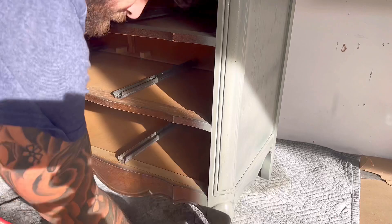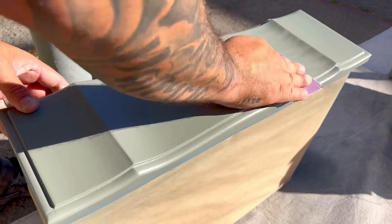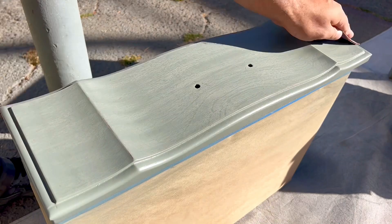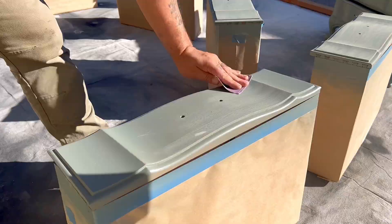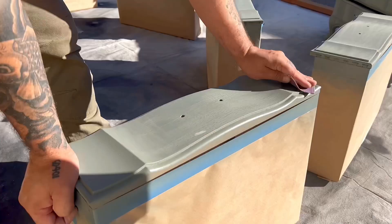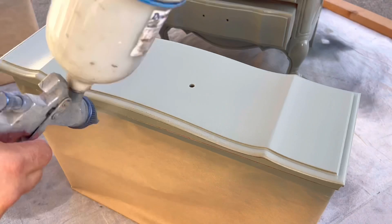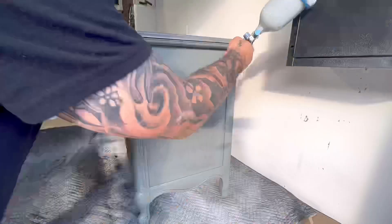After the first coat I like to use 220-grit for a scuff coat, then switch to 400-grit after that so I don't leave deep scratches — if you put a layer of paint over deep scratches, you're going to see them. The scuff sanding between coats isn't just for paint bonding; it also smooths the surface. After spraying a coat or two, running your hand across it will feel very rough, especially if dust attaches while it's drying. That sanding takes care of all of that and gives you a nice smooth finish.